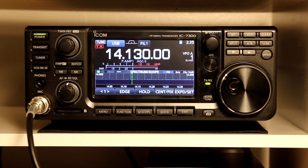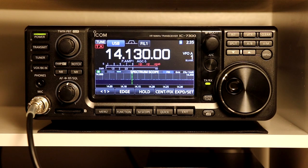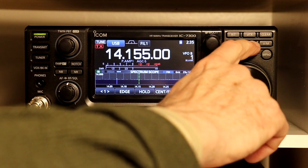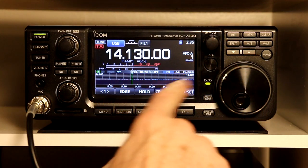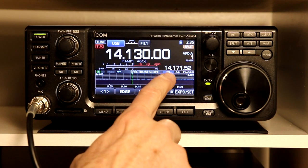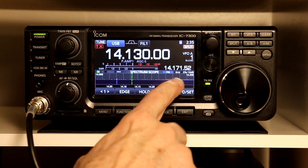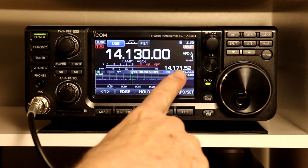On page 3-6 the first thing they talk about is entering a split frequency offset directly. We haven't talked about split mode so let's cover that briefly. There is a split button, and normally if you have something in your B-VFO and your A-VFO and you press the split button it says you want to operate split — you see the highlight on the display and it puts the other frequency on the display. This means you receive on one frequency and when you transmit, it goes to the split frequency.